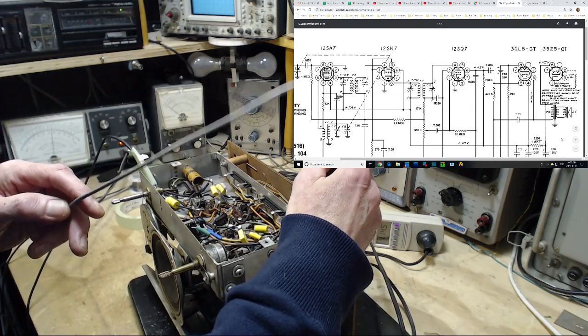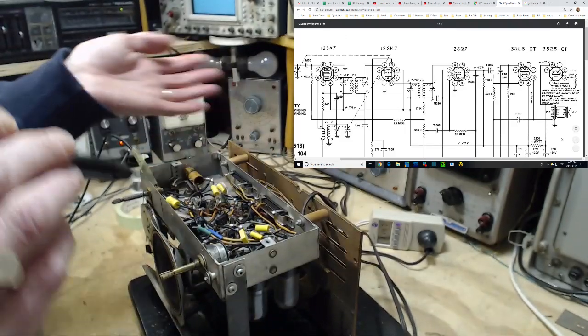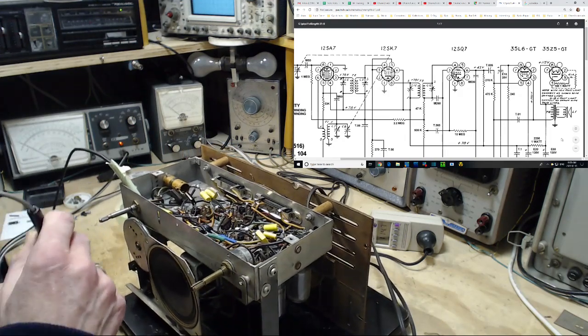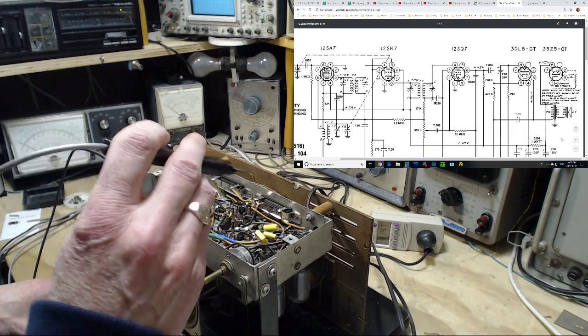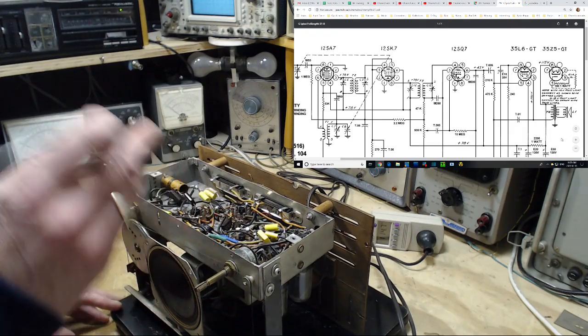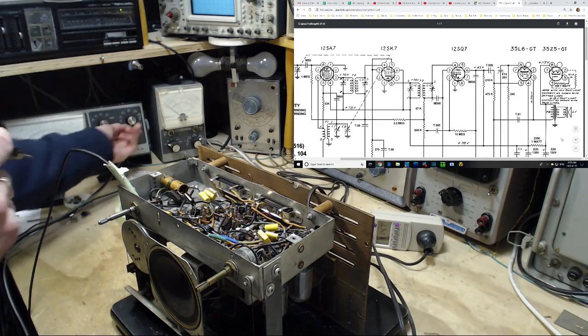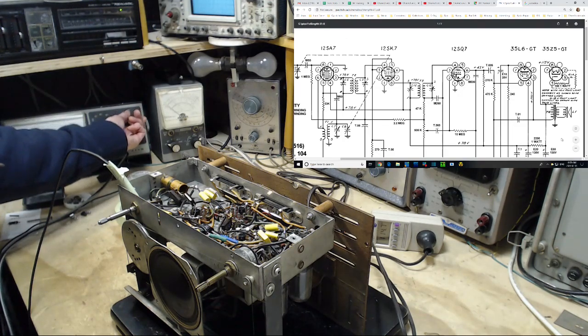That's a similar voltage, 90 volts. So the screen's a little lower than the plate. Sure seems like a good idea to me. So I think that checks out okay. We'll try the grid bias measurement here. Flip my meter onto negative, so a negative voltage goes upscale. Make it a lot more sensitive.